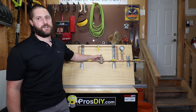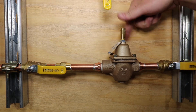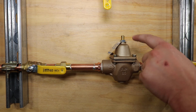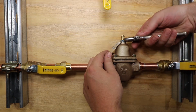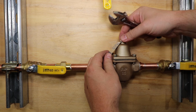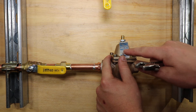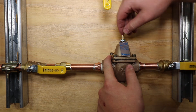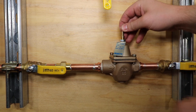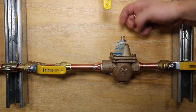Then we have the final isolation valve. Let's come in a little closer and I'll show you how to adjust the pressure of the pressure reducing valve. First step is to remove the top portion here just by unthreading it. There's a lock nut which holds this threaded portion in place, so you just back this off. You can see this tag here — it's set to 15 psi and it has a range of 10 to 25 psi. This pin here, if removed, would push pressure on the device to actually let water flow through.